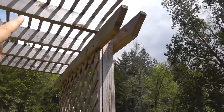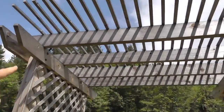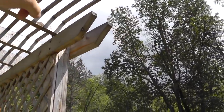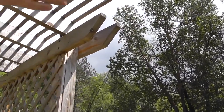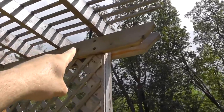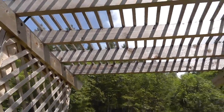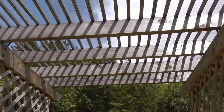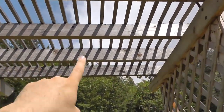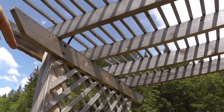For the upper piece, I ran four two-by-sixes — two on this side and two on that side of each four-by-four — and then I beveled them so the rain will drip off, and it looks a lot nicer that way. I secured it with four bolts: two here and two down on that side, same over here. Then I took four more eight-foot two-by-sixes, beveled them also, and ran four across like that, toenailing them into the two-by-sixes running this way and into the four-by-four.